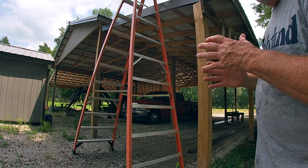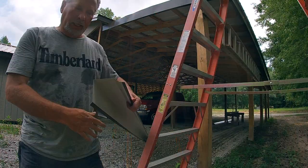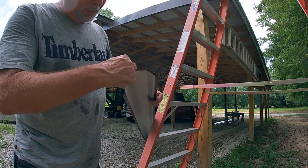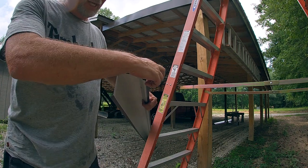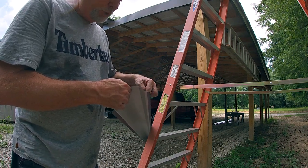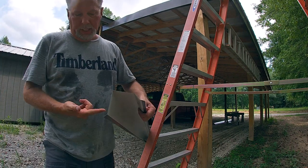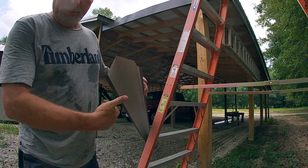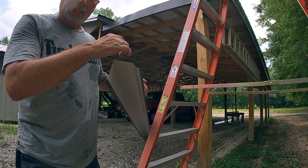When I had them made, I ordered them just a little bit long so I had plenty to work with. You'll see that there's a flat spot, a ridge up, down, and a kick-out. The kick-out is to throw the water off, and the flat spot is where you line up to put your screws in to lock this in place. We'll do screws on top of this flat ridge and then screws into the side. But first I've got to get this measurement — I'll mark it with a Sharpie and get it cut to length, then we'll install.